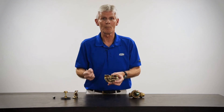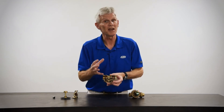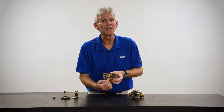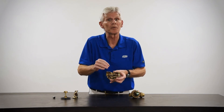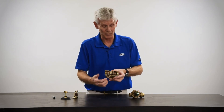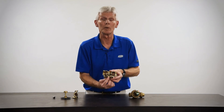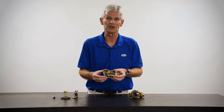So when you go to repair your Model 500 XL, my suggestion to all my customers is: take the valve apart, inspect that bore thoroughly, and as long as that bore can be cleaned up and polished with a little sandpaper, a rebuild will be absolutely fine. Again, if you get in there and find this particular O-ring bore is washed out or has any grooves in it, the valve at that point would have to be replaced.